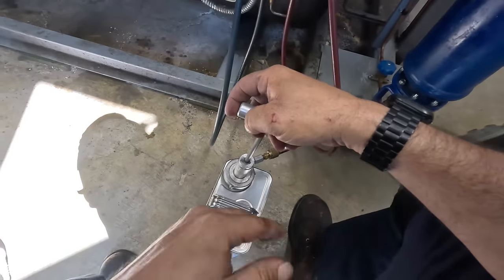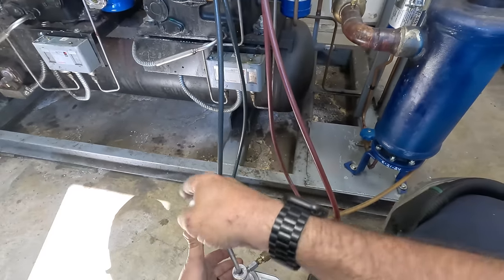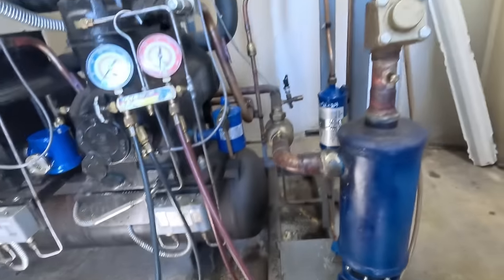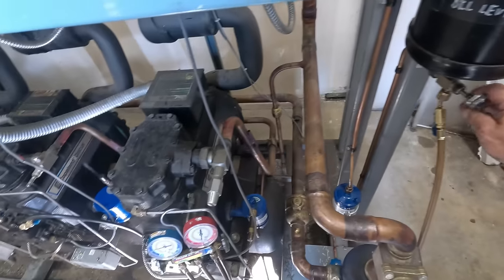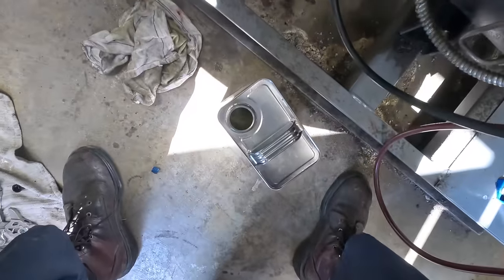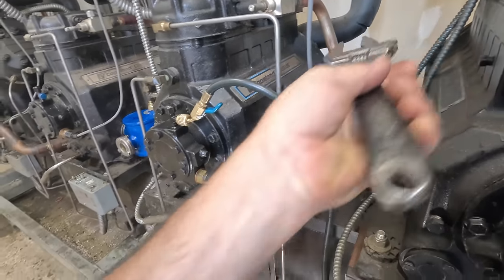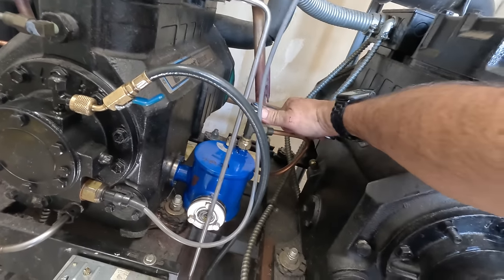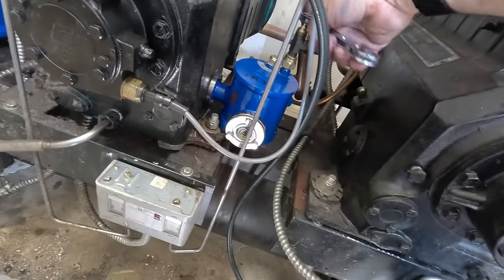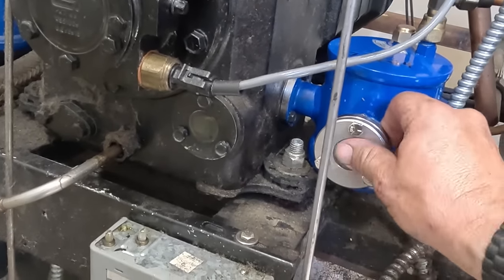We just finished our vacuum and released the suction pressure, making sure we don't have anything leaking — which we don't. We unhooked the hose, bled everything out, and we're pumping oil back in. We get the bottom filled up. The Pretzel Witzel — Advanced Refrigeration Podcast — got back to me and sent me the directions I hadn't looked up. You're supposed to put the flat seal on the float side and the O-ring on the glass side and double it up. We went ahead and corrected that.